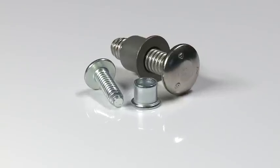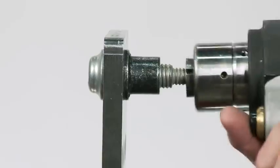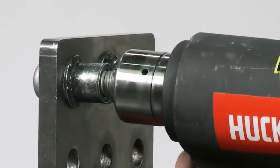It doesn't seem like a lot when we're talking seconds, but multiply that by hundreds of thousands of fasteners and that number can be substantial. The difference is in the technology, in the way the Huck fasteners are engineered. Unlike conventional nuts and bolts that are threaded on, Huck fasteners are swaged on. Swaging takes fractions of seconds to occur, while threading takes much longer.